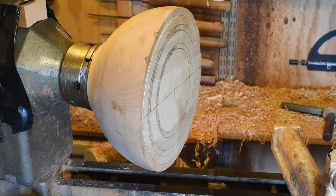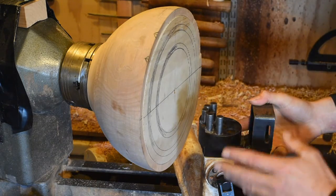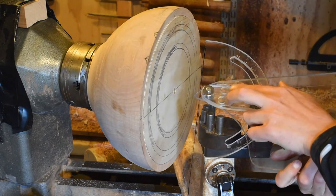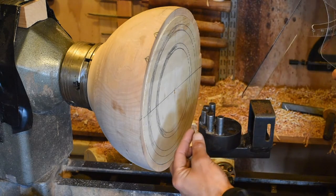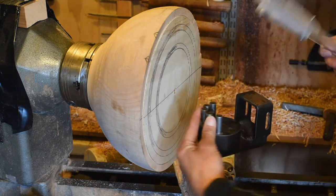So now that we've got the angle finder jig set up correctly, what we need to do is to get the gate set in the right place. Now to do that, pop the gate into your banjo, and then with the jig you'll find that there's 2 large holes on the bottom of the jig. What you need to do is place them over the 2 pins that you'll be supporting the blade with, which, because I'm using the medium sized blades, it's going to be these 2 pins here.